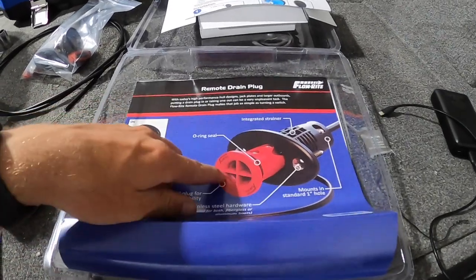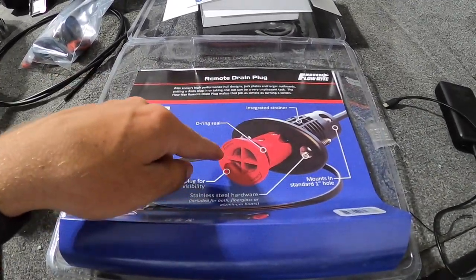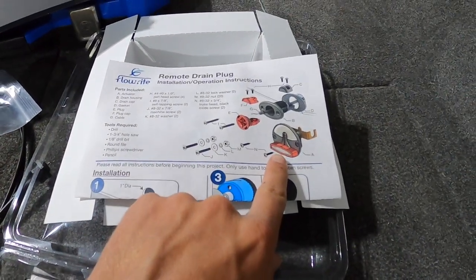Here's what the drain plug looks like. The red portion is the actual plug, the black portion is the housing. The actual plug itself is either going to be pushed out or pulled in via this cable with a little switch. You can rotate it to get it to come in and out. It's really handy so you don't have to crawl underneath the boat and put the plug in or take it out. These are honestly just kind of hard to get to — you hit your head on the prop, getting real low on these boats. In my case, it sits on a lift about 99% of the time, so it's impossible to get all the water out of the bilge. Having this will be nice to get all the water basically out of the bilge so you don't get any mold.